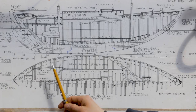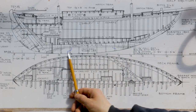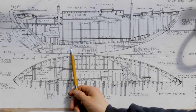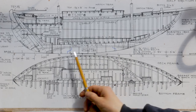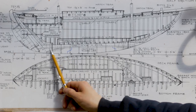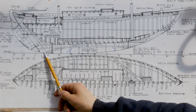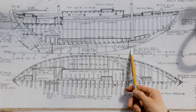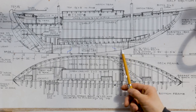When the plans were originally drawn, they were drawn with an iron keel — you can see the outline of that here — which goes under pretty much the whole bottom of the boat. Since lead is so much denser, the lead keel is represented by these blue lines here. So what we need to do is fill out fore and aft of that with deadwood. That's quite a bit of timber — about 14 inches wide up here, 10 inches wide down here, tapering back to about six inches where it meets the stern, and same thing in the bow.